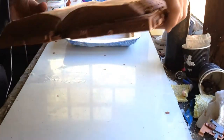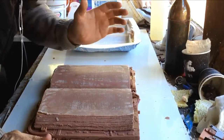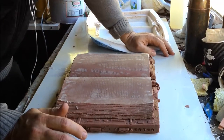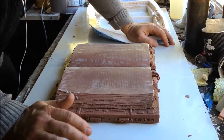You can see — I don't know if you can see up close — but it's got all the detail and it's in plasticine, which means I can start manipulating it. One of the things I discovered: once I used our mold and did a wax cast, from there I was able to measure the wax, convert it into the silver — and I was about a kilo and a half over what I was expecting.